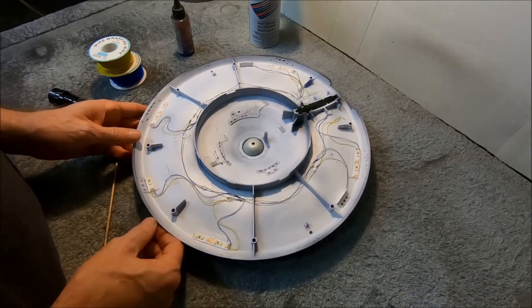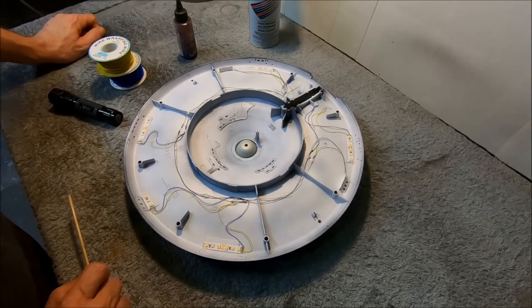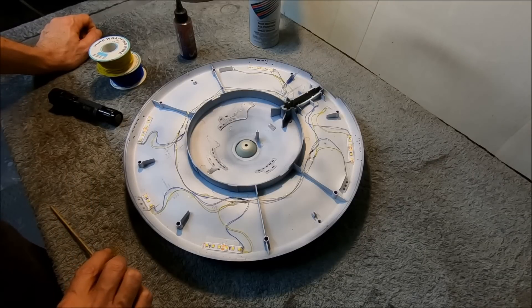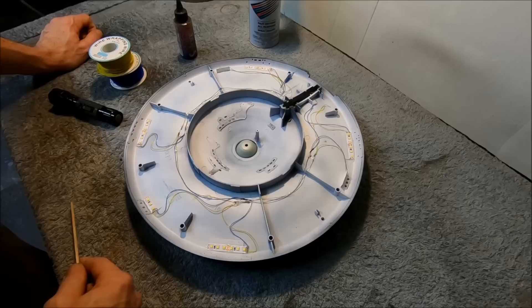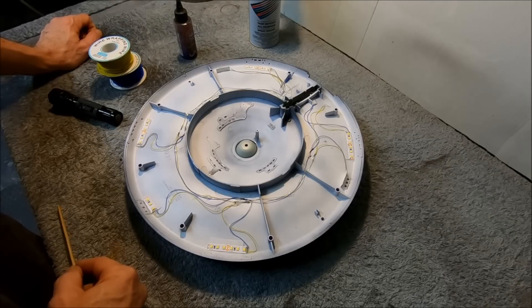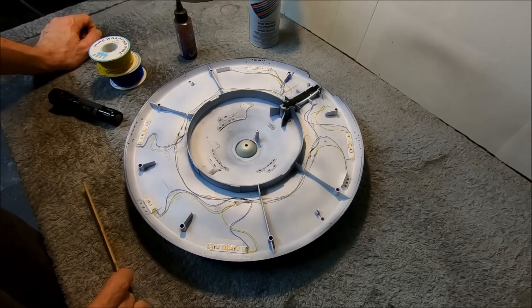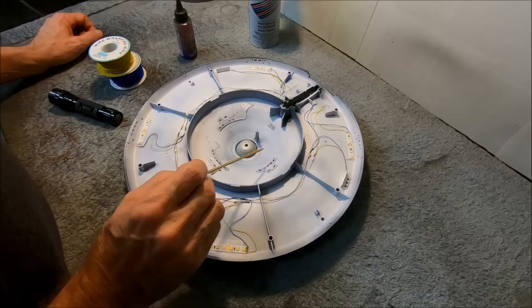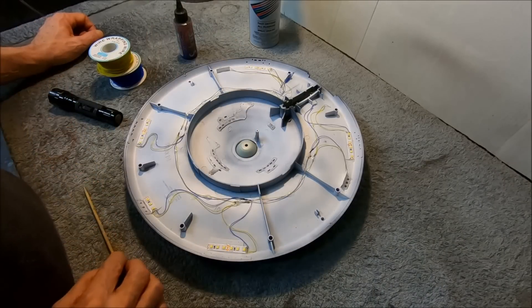The dome technique will come with a little bit of practice, and you can use it for a lot of things — running lights or other details on your models. That's the basic first steps of how I get the lower half of the saucer prepared. I basically come in and do the same thing on the top of the saucer, and we'll show you what we're going to do with that here coming up. Then in the next video, we're going to move on to the secondary hull and how I prep that and get the initial lighting, electronics, and wiring installed. I'm going to take a quick break, come back, and install my SMDs and my 5mm white LED here in the center, and we'll show you how we've got all that done and how that looks.